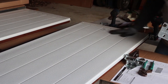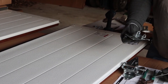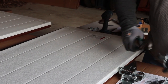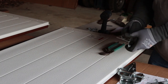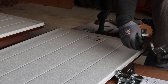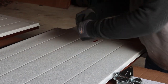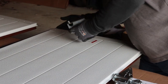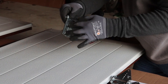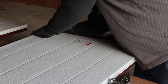I got my door flipped back over. Here's the bottom edge — on the bottom edge go these bottom brackets. When you break them apart, you might have to break off a little tab that's left over. These are left and right, so that one goes over there. Left goes on this side — they're marked with an L and an R. There are little slots on the end that these little tabs slide into and slide up.